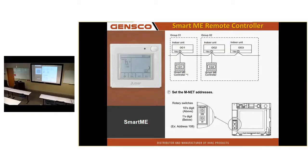It happens so often, it's crazy. And I get in an argument with one guy 7 times about first digit and second digit, what that means. So I came up with a new addressing scheme for those pieces of equipment. We set the outdoor unit to 55. Can't get it backwards.